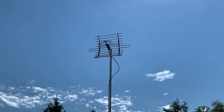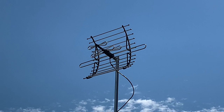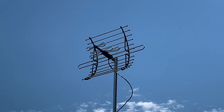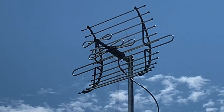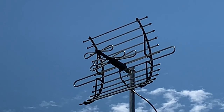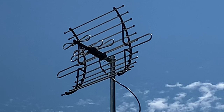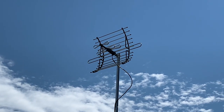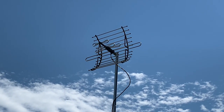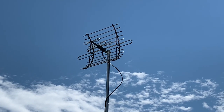The back reflector on this antenna seemed to hamper reception rather than help it. While this antenna was able to pull in the two low VHF stations in my area, other small antennas have also done that, so I can't specifically recommend this antenna for low VHF reception because it's just too small. If you're going to mount this antenna outside, make sure it's mounted as high as possible and point it carefully in the direction of your local broadcast towers. If mounting in an attic, be aware that roofing and building materials will probably block a lot of the TV signal.